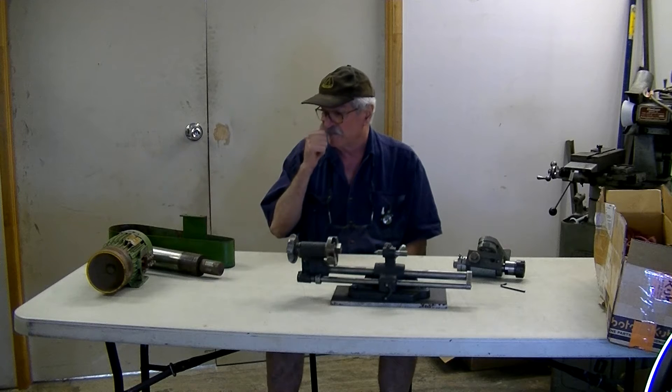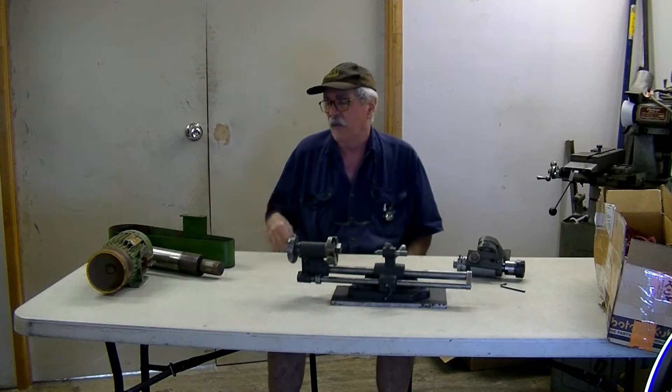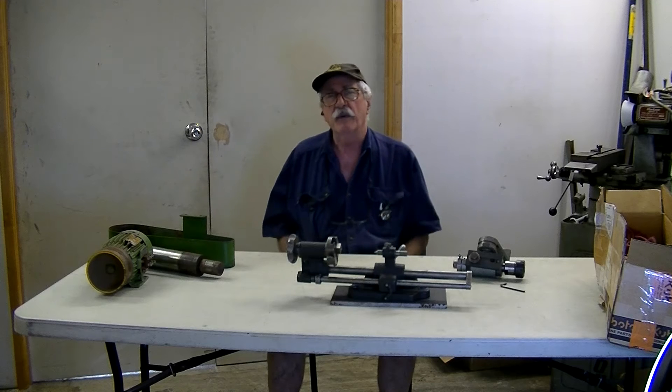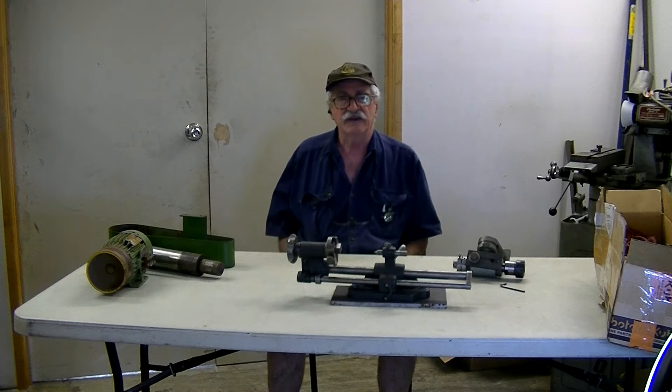Happy with what I've got. I'll have to muck about with the drive belt to get the Cincinnati pulley running at the right speed. I do have another pulley on a high speed attachment and it might be spot on. The pulley appears to be the same taper as the Cincinnati grinding mill hubs, so I'm going to have to make up some hubs in the future, but we'll see how we go.